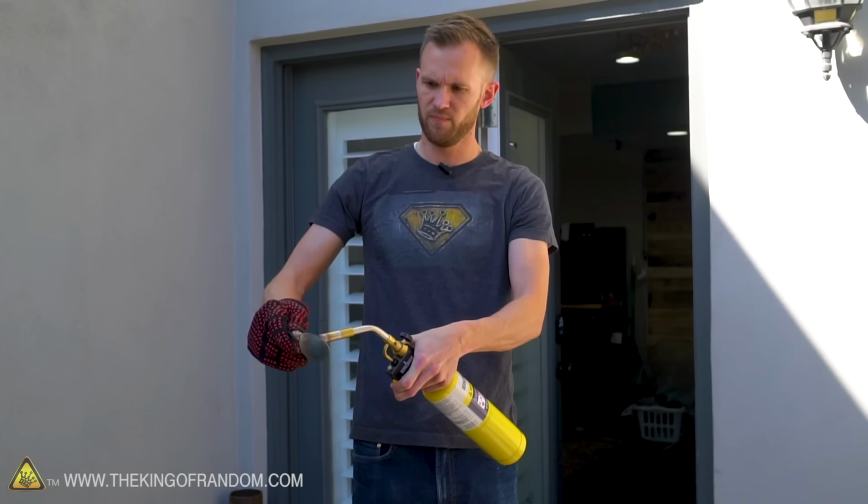We don't want it to be, you know, this foundry gets up to 2,000 degrees. We're shooting for 600, maybe 700 degrees total. It melts at a little over 500. To get it more uniformly even, apparently it's good to get it up to 600 or 700. So it is kind of tricky to do just on a stovetop, but that's why we're using the foundry.